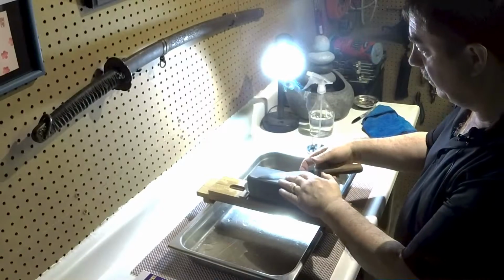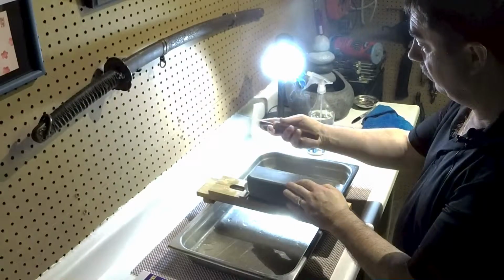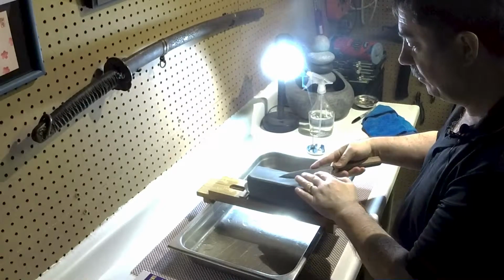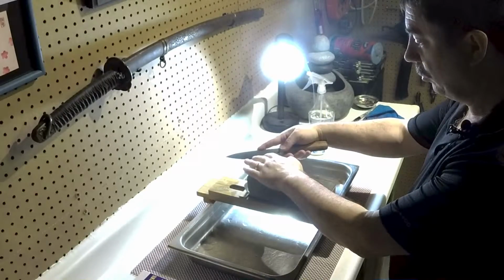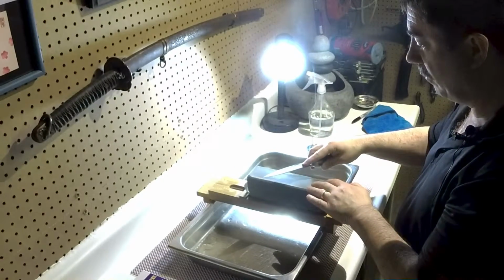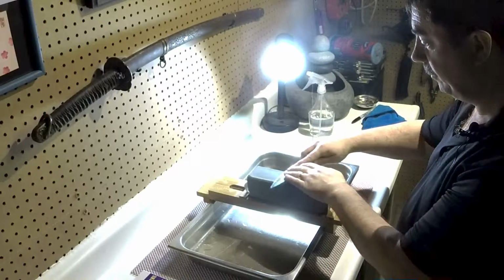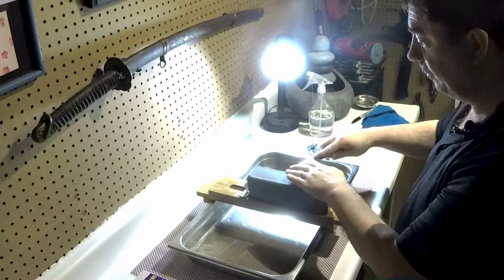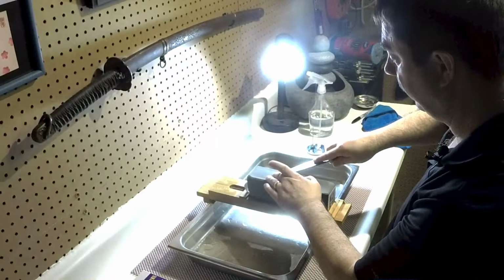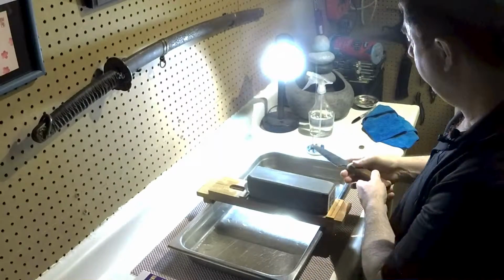And what I've done is set the first bevel on this, and easy, I'm just grabbing it that way, spine, bringing it this way, pressure going on the backstroke, light coming back. When you turn it over, you're taking it this way, and you're bringing it this way. And same thing. When you get to the tip, all you're doing is lifting, you got to lift up on your elbow. Again, back this way.